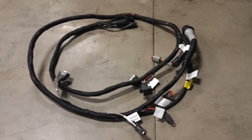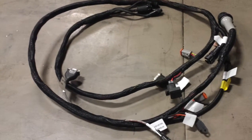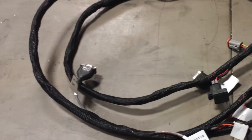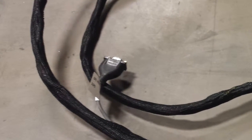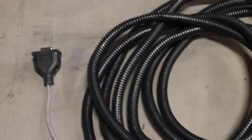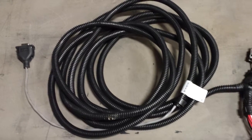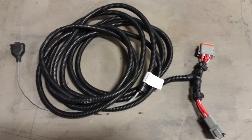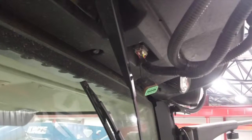If you follow down to your very first connection, it's going to be labeled GPS Receiver DGPS. Once you've located that cable off of your display harness, plug in your serial connection from your John Deere Starfire receiver cable. Plug those two together and then we're going to route the rest of the harness outside of the cab and up to the Starfire receiver location close to your wiper motor on the front side of the cab.